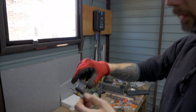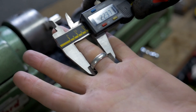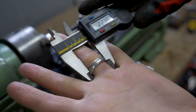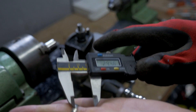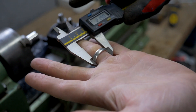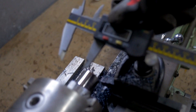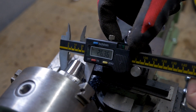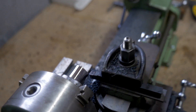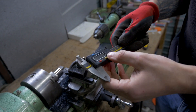What we're going to do is measure my existing wedding ring to get an idea of the diameter. So we're going to use our digital calipers — just reset them and pop them onto my ring. My ring is 22.3mm in diameter and the height is five and a half. Currently the piece of Damascus is about 26mm, so I've got to take about four millimetres off there to get a similar size to the ring I'm currently wearing. Digital calipers are great.